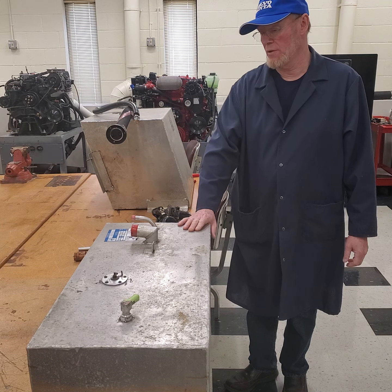To get started, the tanks have to be made of a certain material and they have to pass Coast Guard regulations, Code of Federal Regulations or CFRs. One of the standards is you have to know who makes the tank, what it's made out of, what its capacity is, if it's aluminum like this, how thick it is, and what application it is. The tank will typically have a tag or plate on it certifying it for marine applications — whether it's plastic, composite material, aluminum, or stainless steel.